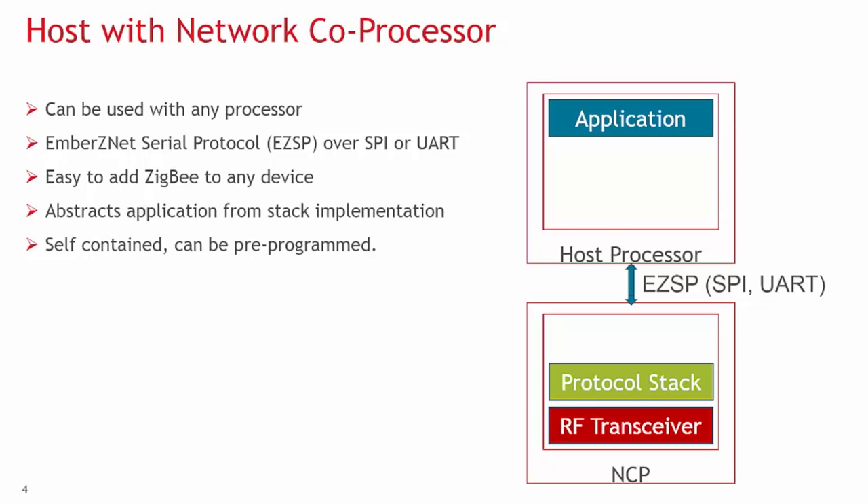The NCP could be sourced from a contract manufacturer as a pre-programmed or pre-loaded chip, and the application can be customized further by the OEM. The trade-off is a more flexible approach, though it is a two-chip solution, so the cost is higher. Decoupling of the host and NCP allows you to future-proof your design, and if Silicon Labs comes out with a new co-processor, it will be easier to update the design. Minimal change will happen on the application host side because the serial protocol will be the same.